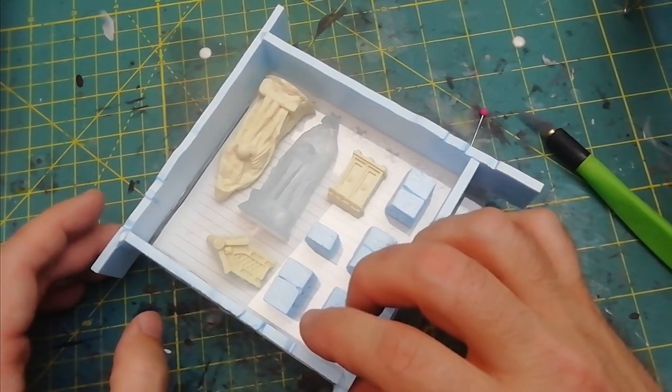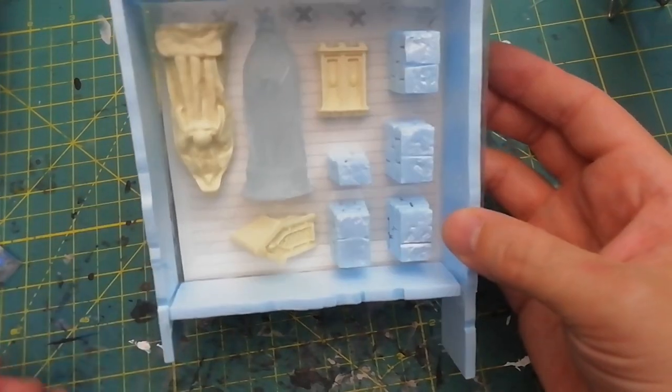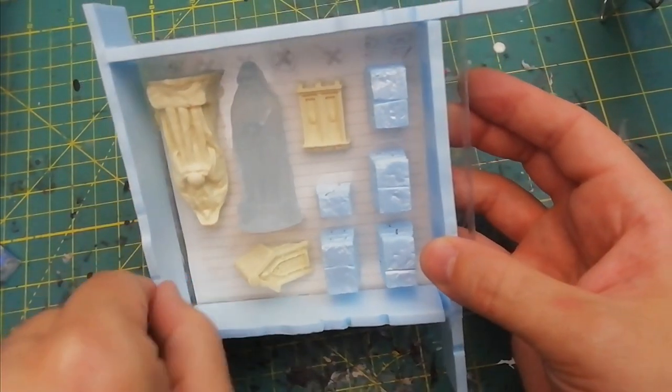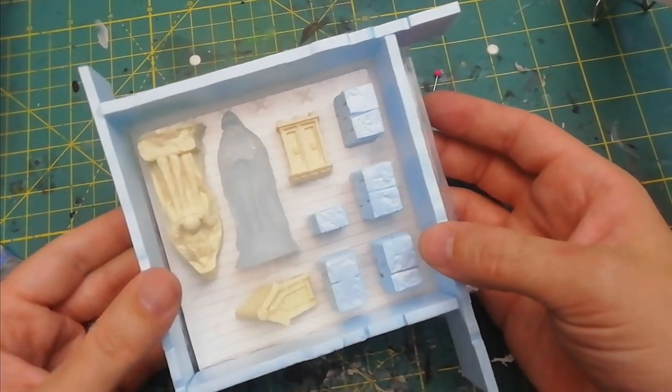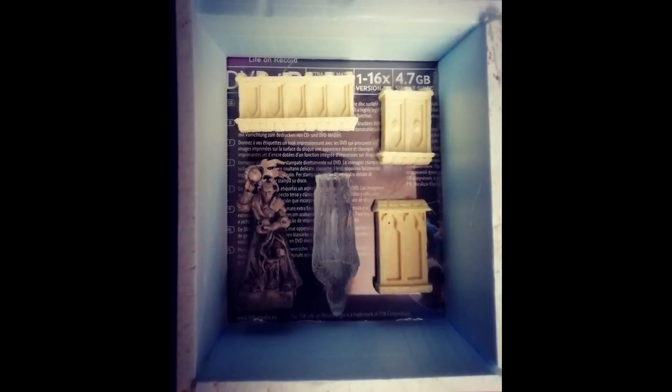Attach the plastic or resin pieces with super glue. A few drops are enough. The pieces in XPS foam are fixed with the hot glue. Remember that for single valve molds, like in this case, the pieces must adhere entirely to your base. Avoid holes and level your pieces if necessary for optimal yield.